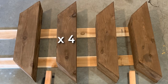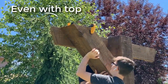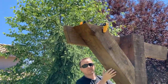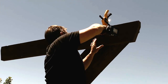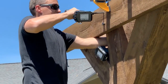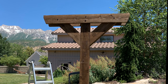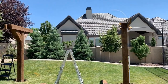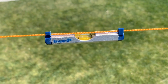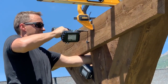You're going to need four of these pieces as well, and they're a little heavier so you'll need some help putting them up — this is my oldest son helping me. When you put this up, make sure the top of the angled brace is exactly even with the top of the cross brace. Clamp it in place; I'm using two of those same lag screws at the top and one 10-inch lag screw at the bottom. Do the same thing with the angle brace on the other side, then install the inside cross brace. Before you attach the first cross piece to the other post, clamp it up there and run a string to make sure the two are perfectly level. Make an adjustment up or down to get it just right, then screw it in the same way. Put the rest of the post together just like the first one.